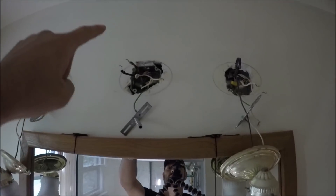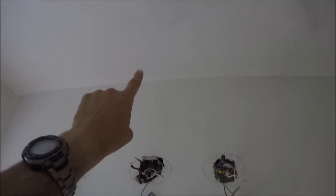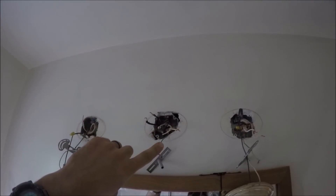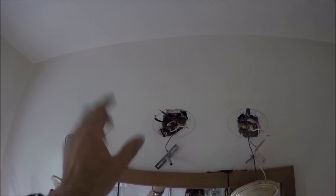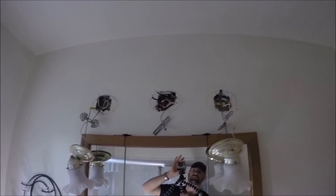When you're switching the neutral, you're taking away one of the safety routes back to the panel. What I'm going to do is trace this up the wall into the attic and try to find where the hot and the neutral are tapped into the system and switch them, so that the neutral will now become the hot and the hot will become the neutral. That way I won't have to reroute everything into the switch, and we will have a switched hot and a standard neutral.